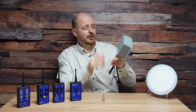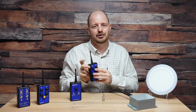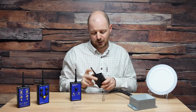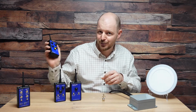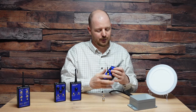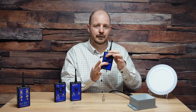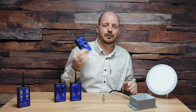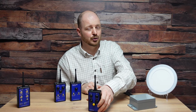Now, to program these remote controls, most of which all of these models work by holding down the solo button in combination with the actual button you wish to program. We can demonstrate this with the 4-channel remote control, just as this one happens to have the battery in it at the moment. So we will hold down solo and A, and we'll hear a long beep, and that signifies that this remote control is now in programming mode. Now, it will stay in that mode for 20 seconds.